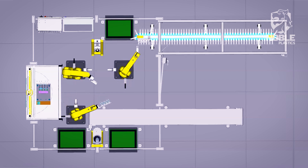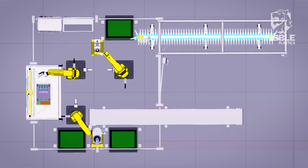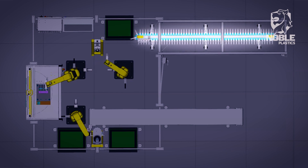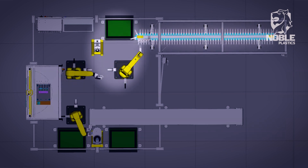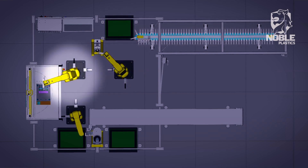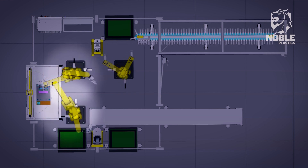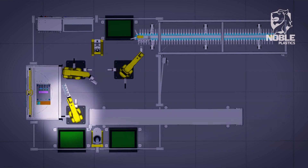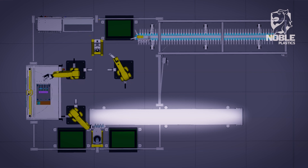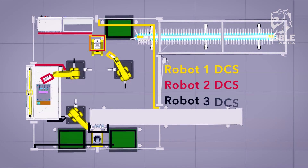The automation process consists of six major steps illustrated by this RoboGuide simulation. The steps are: management and introduction of operator-loaded substrates, incoming substrate inspection and preparation, loading of substrates into the mold, unloading of molded product from the mold, final product inspection, and dispensing of product from the cell. The cell is designed to be tended by a single operator and conforms to a small footprint to conserve production space.